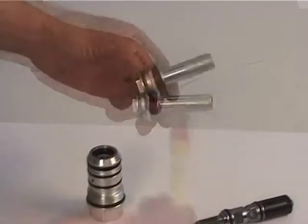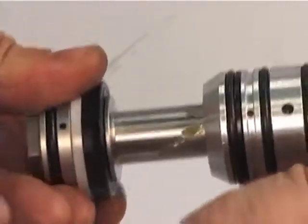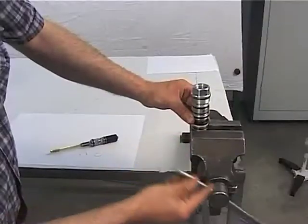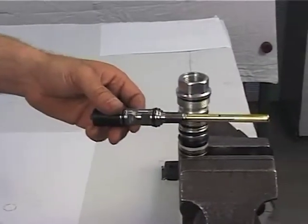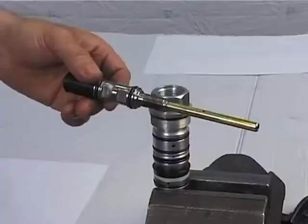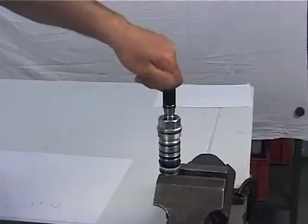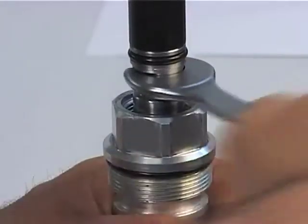Mount the piston, figure 14, onto the front connector, figure 11, after greasing both to lubricate. Clamp the oil dynamic assembly in a vise. Apply Loctite number 270 on the cone holding head assembly, and secure it onto the oil dynamic assembly by means of a 14 mm wrench.